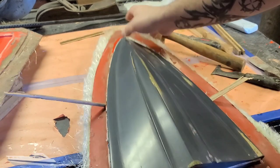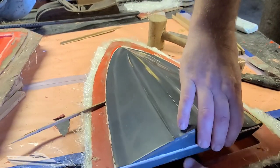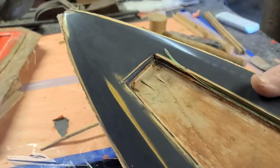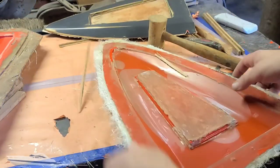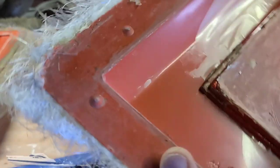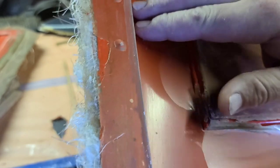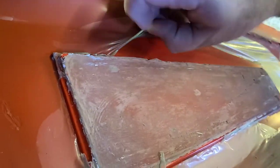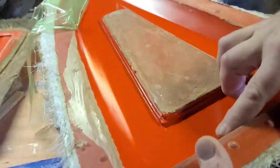The front is wanting to stick a little... oh, here it comes! Yes! The mold came out nice and the plug didn't get messed up — good deal! There's one bad spot where I tore the PVA when I was brushing it on. The more PVA you put on, the better it's going to release. I did disrupt the PVA in one spot and got one bad area, but overall it looks so good — oh man, that one spot though!